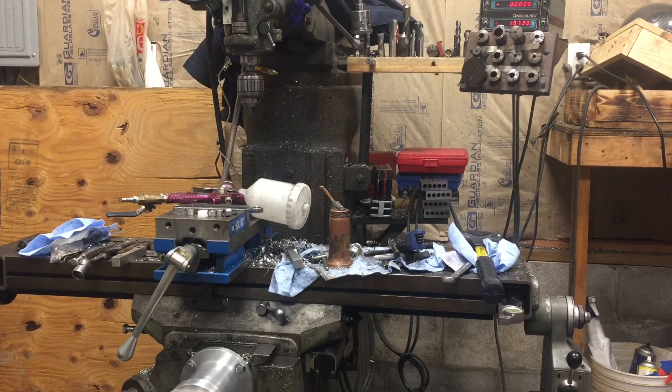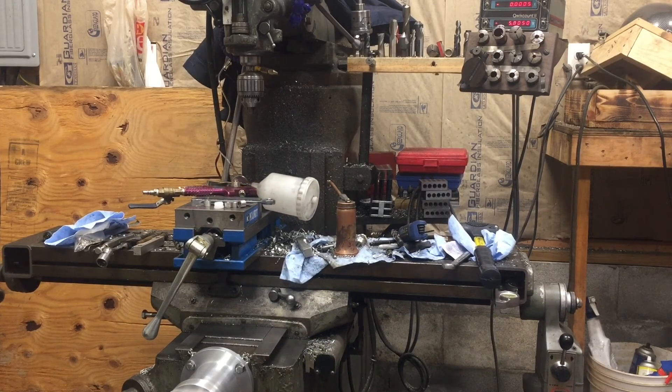At 1200 RPM that did fault the drive — looks like we exceeded the max bus voltage, so it must have fed back some voltage to the power supply. After talking to the guys at ClearPath for about 45 minutes on the phone, basically the only thing you can do to destroy this motor is to wire it up physically backwards on the polarity. They said they're really robust and have an excellent warranty. If you guys are thinking about changing your old machine over, it's definitely a path to consider.